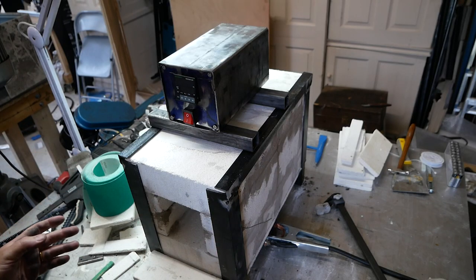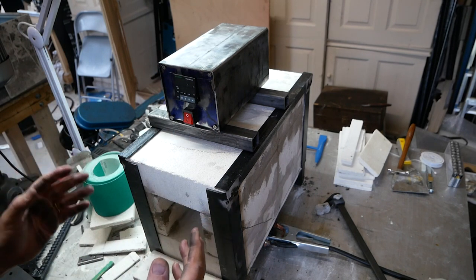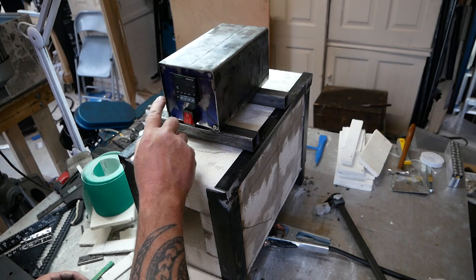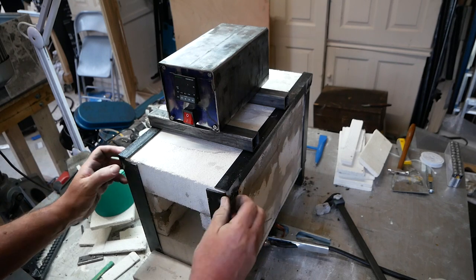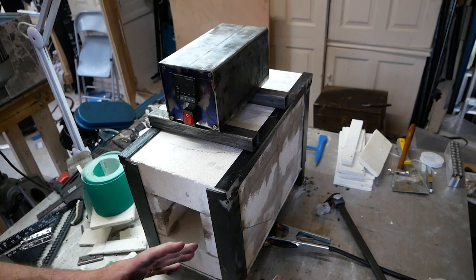In the spirit of not trying to over-engineer things and trying to build braces on the side and to save space, I thought I would put the control panel on the top like that. And then I realized, of course, there is an issue with that because however well the door fits, I'm sure that heat will escape this way. It's bound to. There's going to be some heat. And if I'm wanting to change something on the PID, I'm probably going to be hindered because the oven will take a long time to cool down. There'll be a huge amount of heat coming this way, and it will be much safer to put it on the side. Now I understand why Blackbeard Project, for example, built this on a stand with the PID underneath, and now I understand the logic of that. And you know, with 2020 hindsight, that's probably what I would have done. But so I'm left with actually putting it on the side.